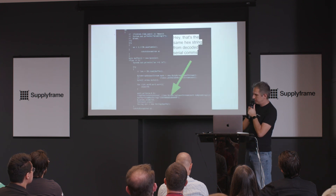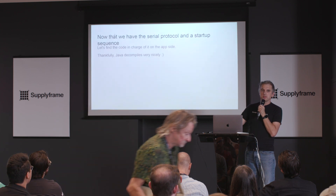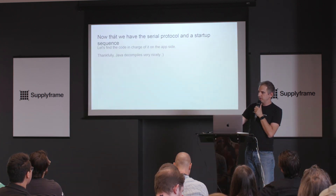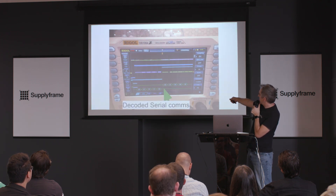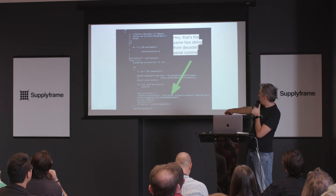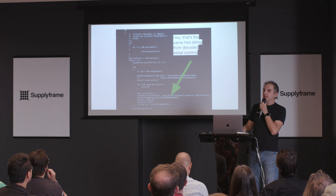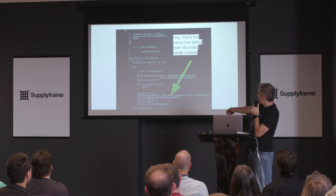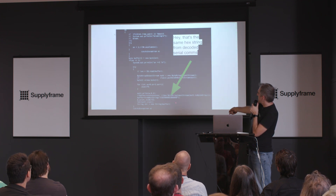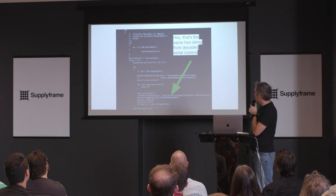I had this serial port available to me. The software was written in Java, and Java is surprisingly easy to decompile. If you look carefully at the string 570700 — I found that same exact string in the Java code — that proved all my research from the actual wire was accurate. This is basically how it initializes the machine; this was the initialization string sent to the controller.